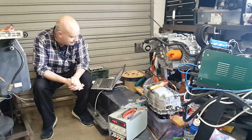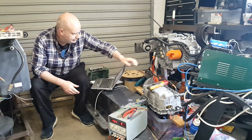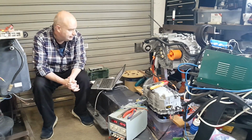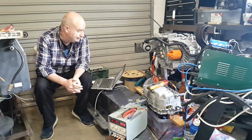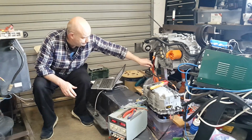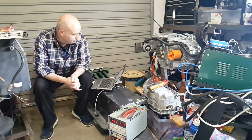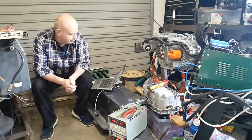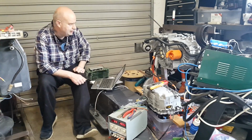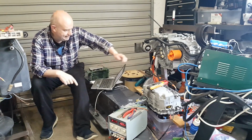So what I've done here is I've gone back and I put the original STM32 sine firmware in here. Put our clamp meter on AC current, and just using manual volts hertz mode, I'm commanding about 3 or 4 hertz into the motor at the minute. I'm seeing about 35 amps AC on all 3 of my phase leads here. And the motor turns, there's no problem there with that. There's no, at least much of a measurable DC component there on our meter, and that's very stable, it's saying 34.5 amps here. And if I look at it on the plot here on the computer, it's within 1 or 2 amps of what it says on the clamp meter.